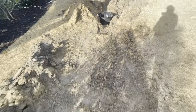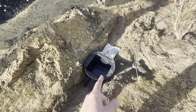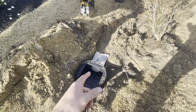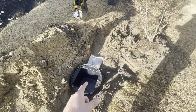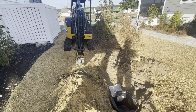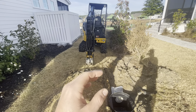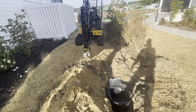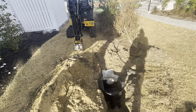We have our second basin in the chain. This pop-up is going to curl in and go into this basin. The basin does three things: it catches water from surface level, acts as a clean-out so you can access the 6-inch pipe if there's a blockage, and it collects debris from the gutter system. We've got the John Deere here and the ground's actually really nice and dry, so this machine just kind of floats right over. We come back with a hand tamper and tamp down where the tracks have risen or sunk in the ground a little bit. Give it a couple months and it was like we were absolutely never here.